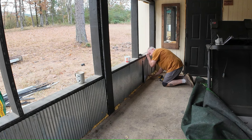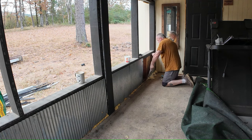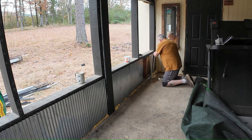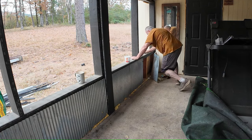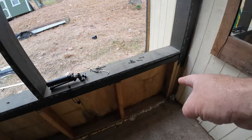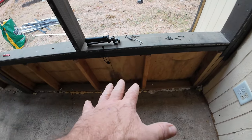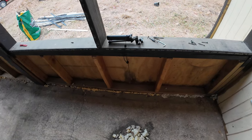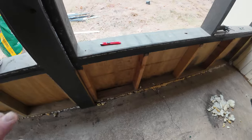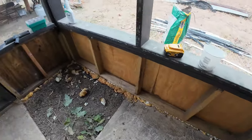I'm going to try to keep my mess to a minimum during this build, because that sucked trying to clean all that mess up. I'm gonna have to get some tools and get that foam cut out of there. Despite the floods we had in here, this all looks pretty good. I'm talking about the two-by-fours - I mean, they are treated. What's saving this is these are sitting on about eight, nine, ten inches worth of stone. There's no way water can just sit there - it's gonna seep down into the stones and stay away from the wood. It all looks pretty good.